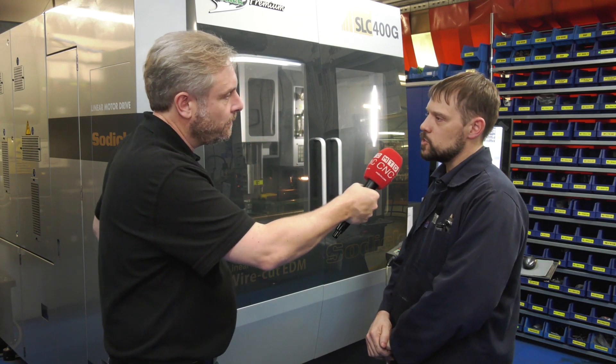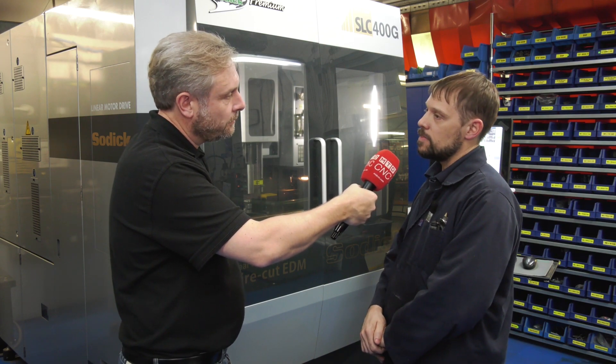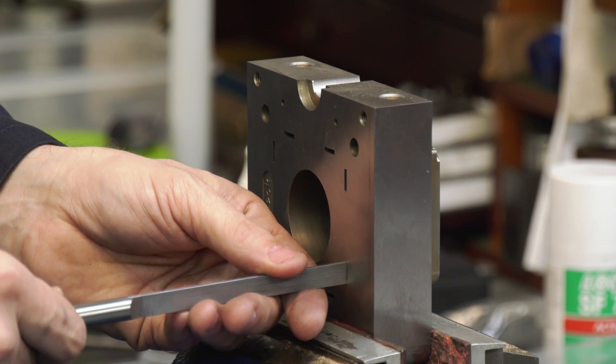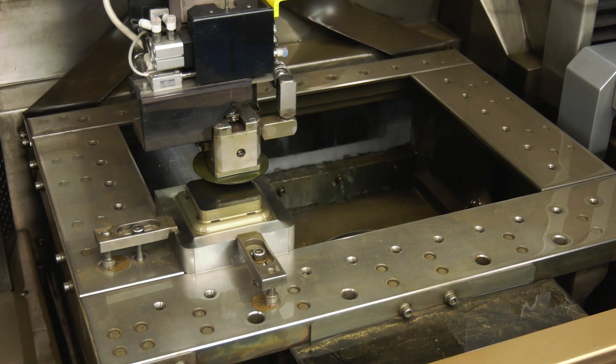Exactly what you need. In terms of the parts you're making — you mentioned accuracy — but you said it's not just about the accuracy. You mentioned an ejector pin. Some of the ejector pins, depending on what material — the job that's in there now, that is moulding santoprene. We can't have like a 0.1 mm gap because that will flash on the plastic part. So you're testing with your own manual ejector pin and you can feel the tolerances. You're making extremely complex parts for this machine, and sounds like it's a very simple machine to use giving you that accuracy. Yes, it is.